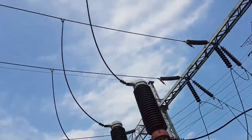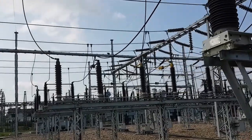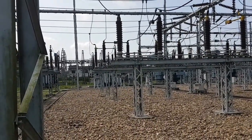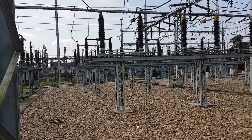From this circuit breaker, it goes to another CT, then another disconnector, then the bus coupler. Through that disconnector again to a side CT, and then to the transformer.